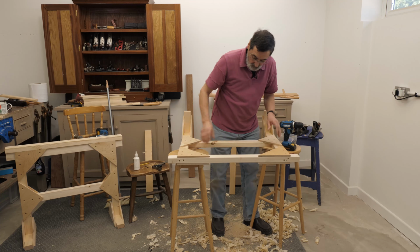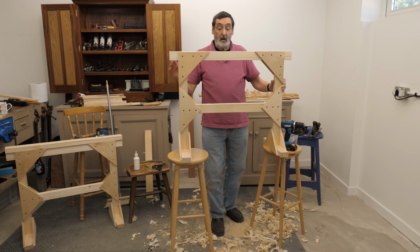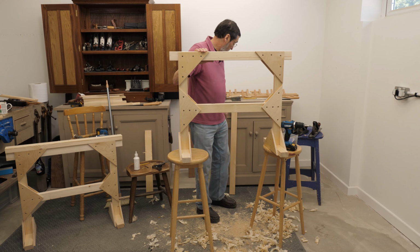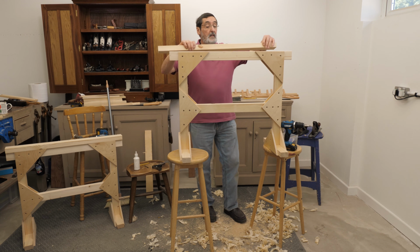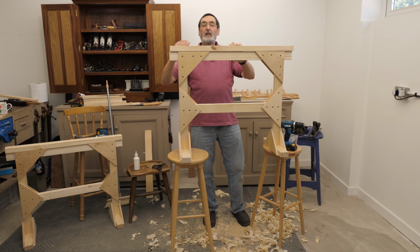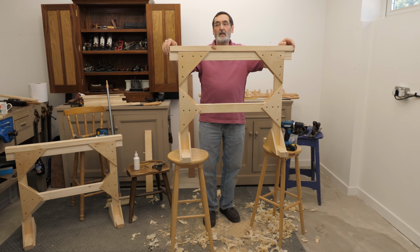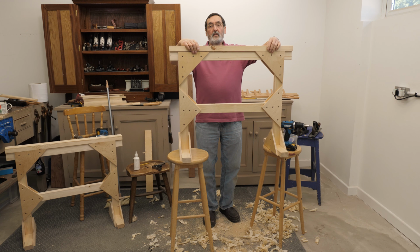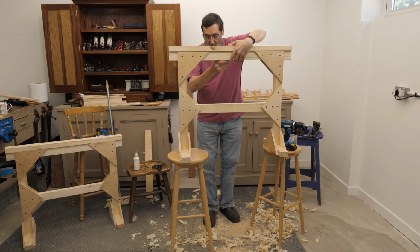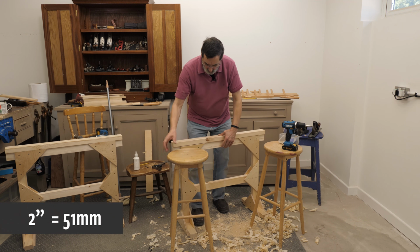All right, there they are. One pair of trestles. I've got one little bit to do next. I've got to put this cap on here. What this cap is for, it's removable. You want this to be removable. What this does is when you're sawing with a skill saw, with a hand saw or something, and you start cutting into here, eventually this becomes a sacrificial piece. And so we can get rid of that, put another piece on, and it won't affect the main superstructure of this. So we're going to take 3 screws, and 2-inch are long enough for this,